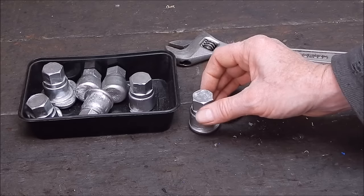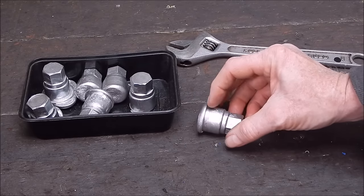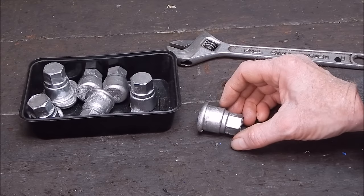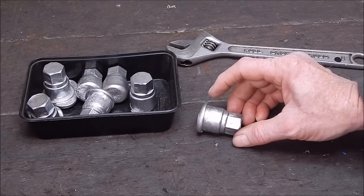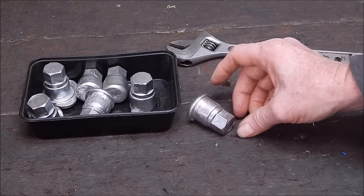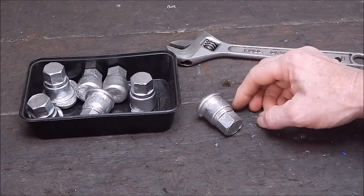The filler plug on it was the wrong sort. The blanks turned out quite well, and then I moved on to cut a thread on them - single pointing the thread, plunging in - and it didn't actually cut very well. In fact it cut awful. It tore the stuff up too much. So I then went to angled top slide, and I'd only just started when the tumbler gears on the lathe cracked out. They were buggered. So I had to switch to making up some new tumbler gears, which worked out great - that was in my last video.